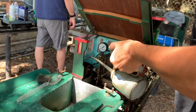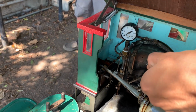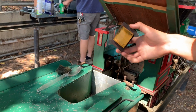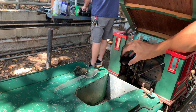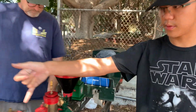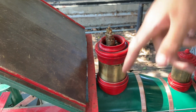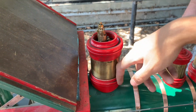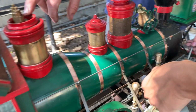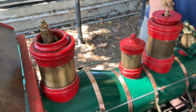Here's our automatic lubricator. It's pretty full, so we're just gonna top it up. So what does that lubricator do? Or what does it lubricate, of course? Basically the internal linkage. There's a little pipe right here that connects to it. It drips down. Not into the boiler, but there are small little pipes that lead to the valve gearing. This is the steam dome. So it puts a little bit of oil in the steam dome, just a tiny bit. Then that goes forward and gets into your cylinders,